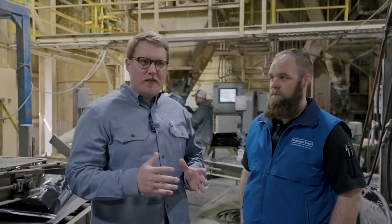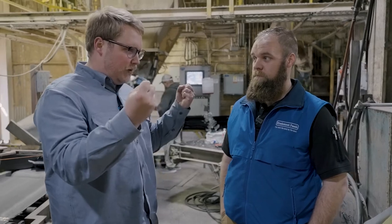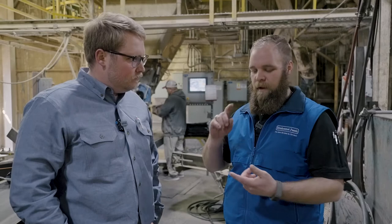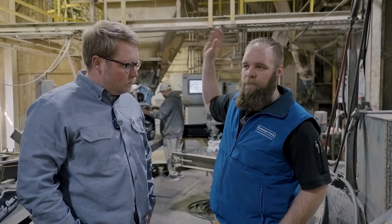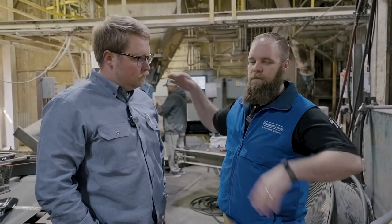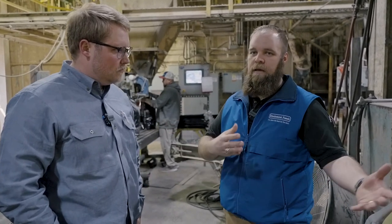The last process before the feed gets loaded onto the semi is the bagging process. Once the pellet is made and the textured feed is made, it dumps here. We got the right pellets cooled to the right temperature, the right product mix — everything correct. It's coming to the sacking line. Up above us, we've got multiple sacking bins that store the feed ready to be sacked. The feed flows down through the process and the first thing we do is screen it — taking the good pellets and removing any excess fines that happened in the conveying process, setting those aside to use at a different time.